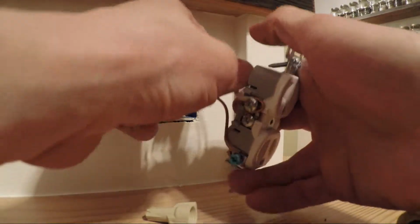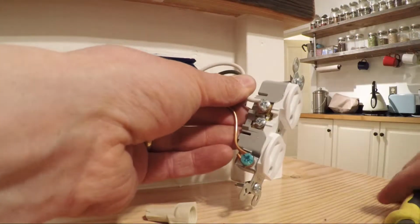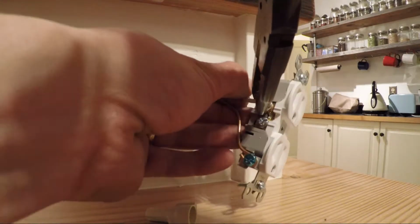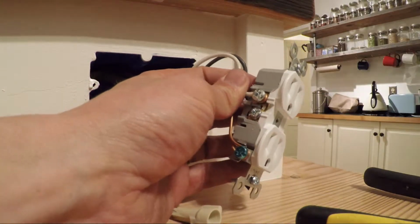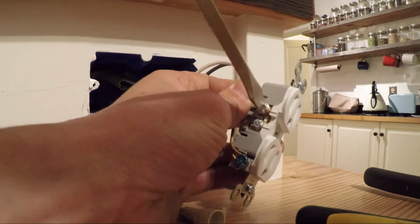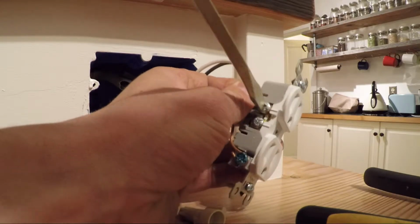When I go in, it just kind of slides in there, and that really saves you a lot of time because of that little extra bend inward that really helps you get in there. And then I just took my pliers and finished that off, so I got a nice good connection around that screw. And once again, I'm going to screw that in until we're snug.